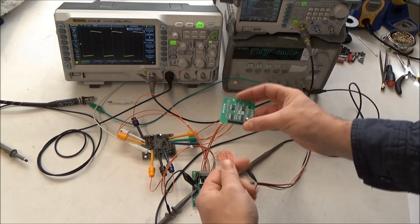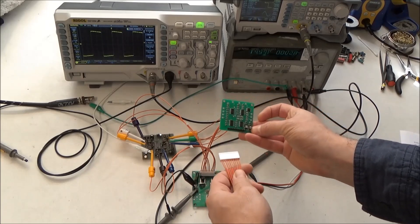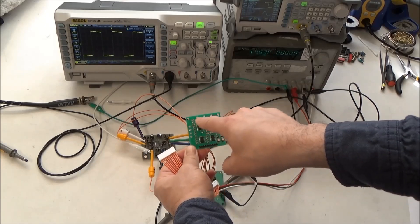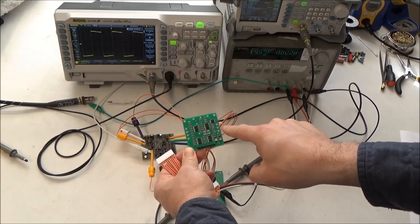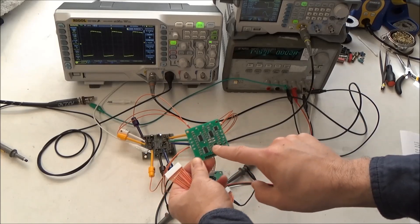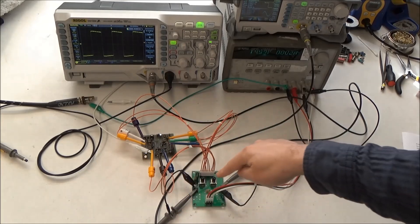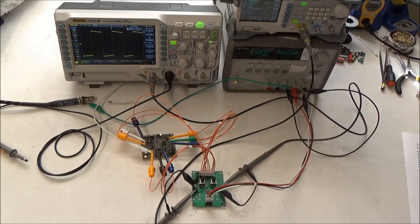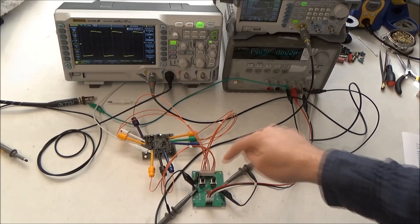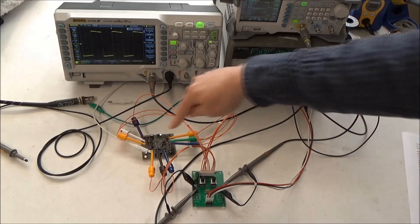The other one is a straight cable which can connect to my replacement filter module. I laid my filter module out so they both can have the long pins in the original places to fit an ARP synthesizer, but it also has a regular header so I can test them easily and so they can be adapted for other uses like in modular synth modules. The test circuit board has a few other components required for the filter to work, and it also has two small pots which function the same as the frequency and the resonance pots on an ARP synthesizer.